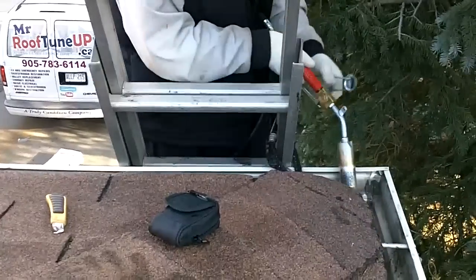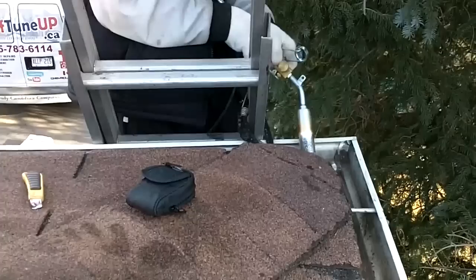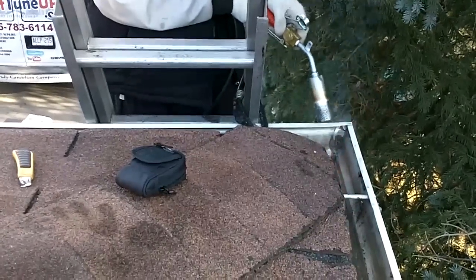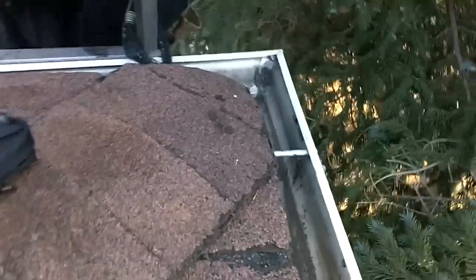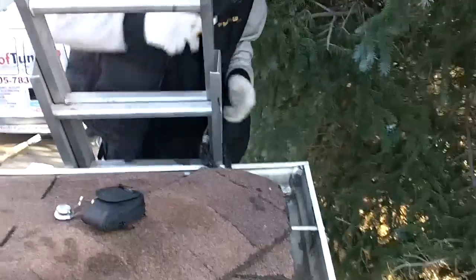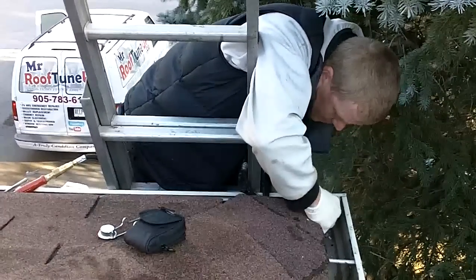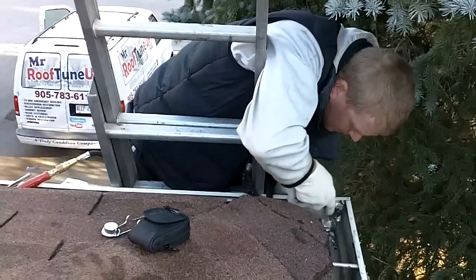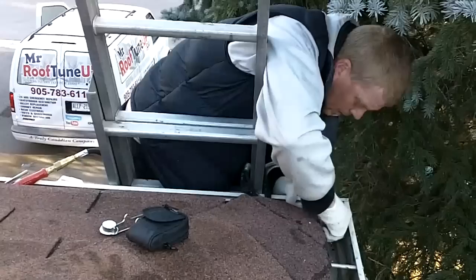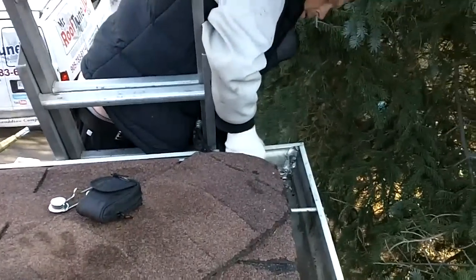The key to doing this is actually to heat up the old rubber and get it off there, so that we can scrape that off and make a clean seam, then we'll put the caulking over it — good for another 10 years. No matter what you use, a flat top screwdriver or anything, you'll see now that the caulking will actually come off quite a bit easier. And you can see how clean we're going to get this — we can take it right down to the new stuff. That comes off pretty easy, actually.